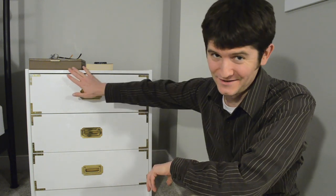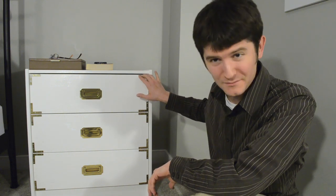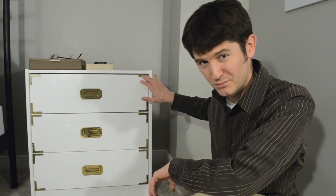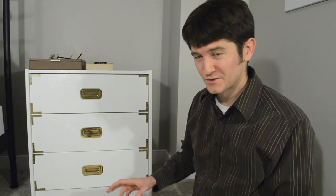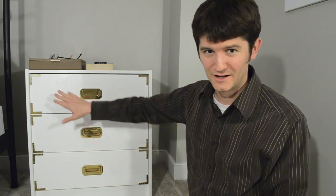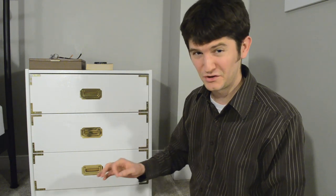The next thing is that the direction these braces face matters. We put together a whole drawer head with the braces on the wrong side and none of the screws would flush against it. If you turn the braces over, you'll find one side has a place for the screws to sit flush with the brace. On the opposite side, the screws won't sit flush and you'll get a much more rustic look than you bargained for. Finally, don't put in the interior screws of the braces — those four screws here — because there are little channels for some of the IKEA pieces so that the drawers fit together correctly. If those screws are in, you can't completely assemble the furniture. Leave those screws out, put all the furniture together, put the drawers together, and then go back and put those screws in as the last step.